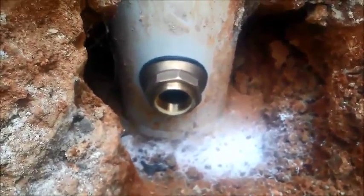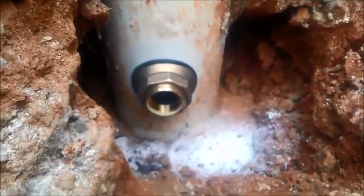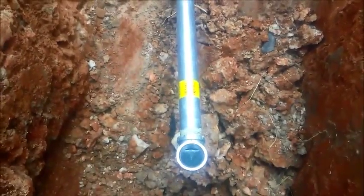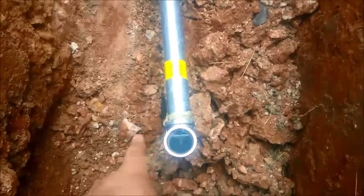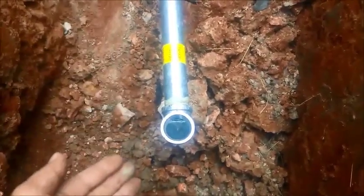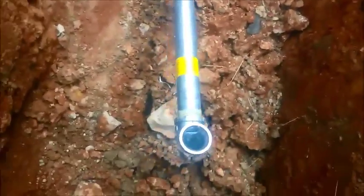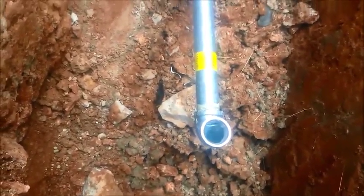The standpipe acts as leverage as we install a 36-inch piece of outlet pipe out to where the dry well is going to be - which is basically just a 55-gallon drum. I'll cut the bottom off, use the top part as a cover, then 90 up into the hydrant. I just installed the outlet pipe - inch-and-a-quarter galvanized steel, 36 inches long - and it 90s up where the frost-proof utility hydrant will screw in with a five-foot height: two-and-a-half feet buried, two-and-a-half feet above ground. This is configured as a non-pressurized system with full-bore inch-and-a-quarter throughout.